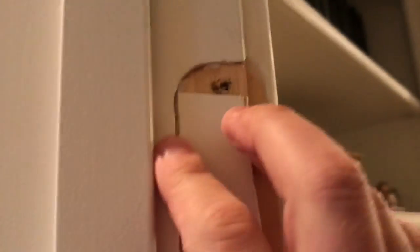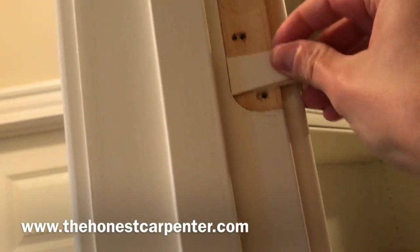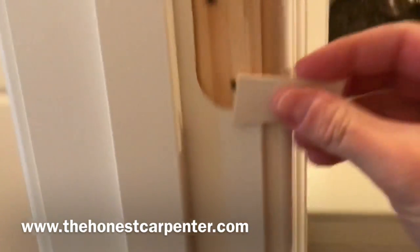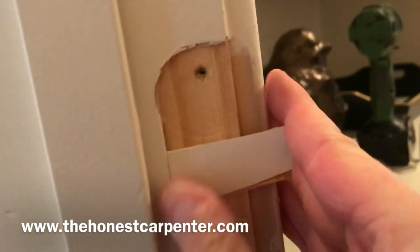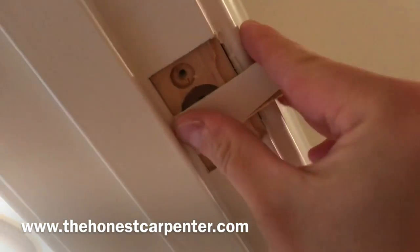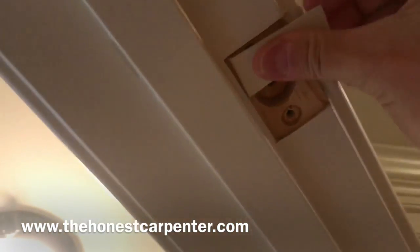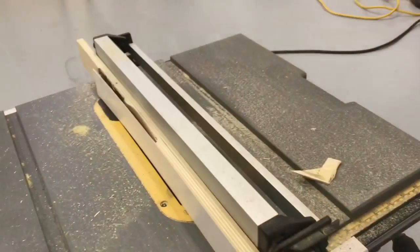I take the test piece inside and hold it up in my mortise slot, feeling the outer edge with my finger. That felt a little high, so I went and readjusted my table saw fence and cut another one — a little bit thinner this time — and here you can see it fits much better. I also tested up at the top of the door where the ball catches sit, and it fits those mortises as well.